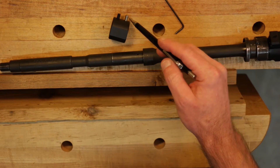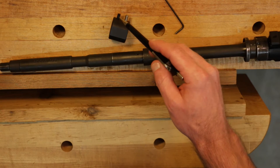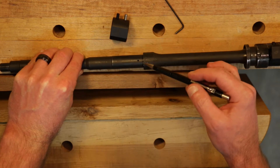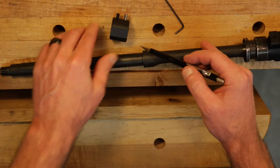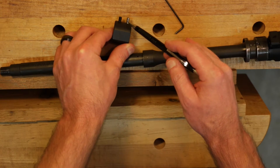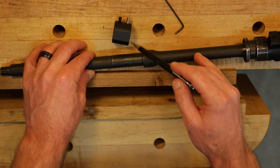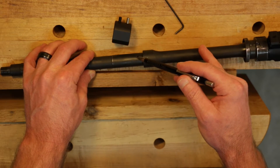On this particular jig, it has two set screws on top — one silver, one black. The black set screw has a pointed tip, and that pointed tip will actually index or seat into the gas port of the barrel. The silver set screw is a soft-pointed set screw, and that just helps lock down this jig onto the barrel, so you can then flip it over and drill your dimples.